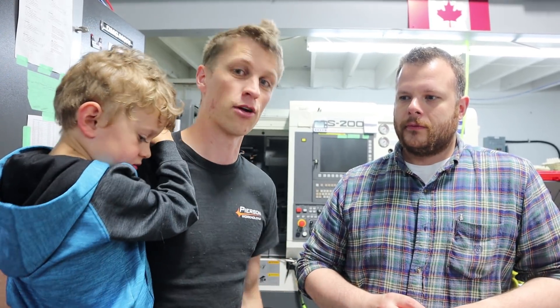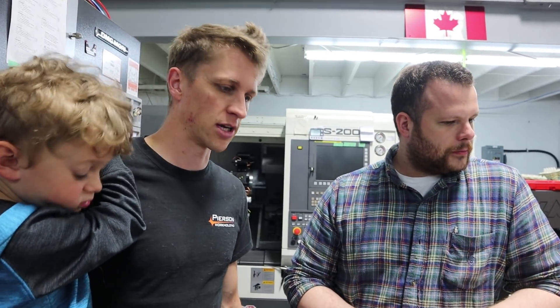With the first batch we made, we were like, okay, this batch of parts fits with this batch of parts, and then these fit with that, and we had to measure everything and pair them together. But that's the learning experience you've got to go through — it was a development, essentially. We want everything within tolerance so that we know it all fits.